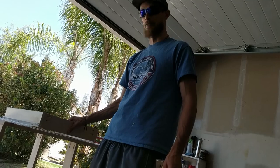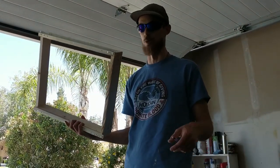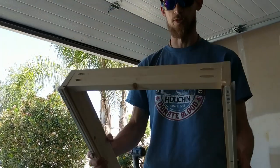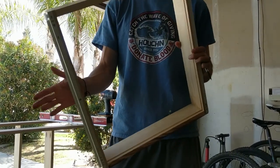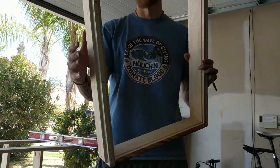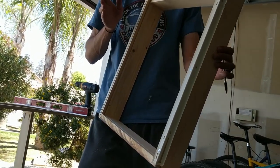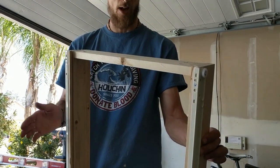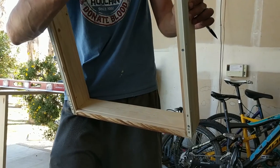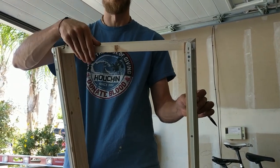I built my first drawer. I'd never built drawers before, never really built cabinetry — never really built anything with any real complexity. So I watched some YouTube videos on how to do this and basically used a table saw to make sure everything was exactly the same height and thickness. Then I went up about a quarter inch and slotted this on the table saw — two cuts to make about a quarter inch slit. After everything's laid up you can see that this matches all the way around. The back one I cut shorter, so I'll take a quarter inch piece of hardwood plywood, slide it in, and put some screws in the bottom to hold it. That's going to be the base of the drawer.